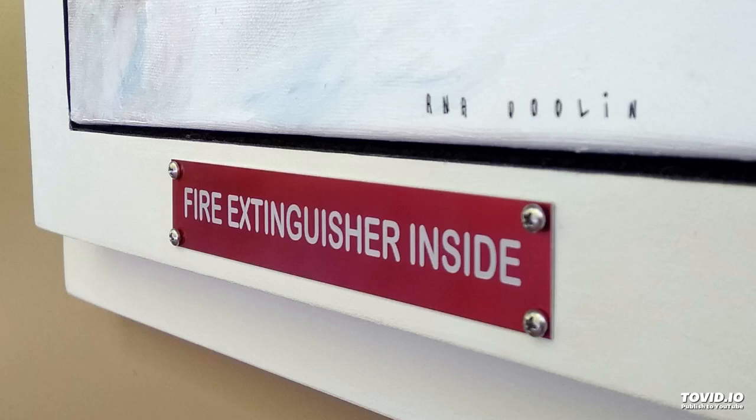And since you were smart enough to put some newspaper on the floor, it'd be a good time to wipe around the opening with a clean, dry cloth. Now we're looking at the drywall shims that will attach to your cabinet with Velcro and hold the cabinet in place in your wall. And we made it easy. The Velcro is already attached, and we included 8 shims total, 4 thin ones and 4 thicker ones.